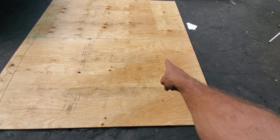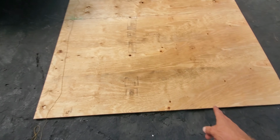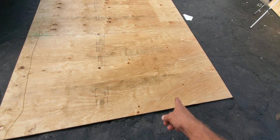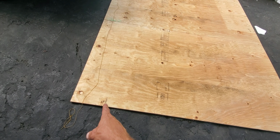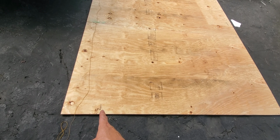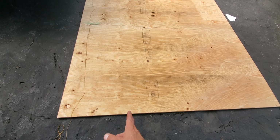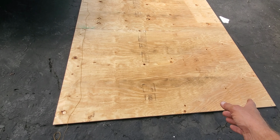The ramp's going to radius down this way, okay? To the point, from the high side towards the beginning of the ramp. You want to pull from your right side over this way. You want to bring it over 7 foot or 6 foot, whatever you want your radius to be. If you want a 6 foot radius, pull 6 foot off that right corner.